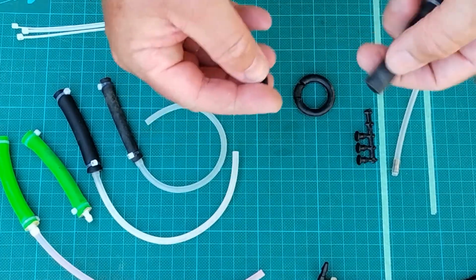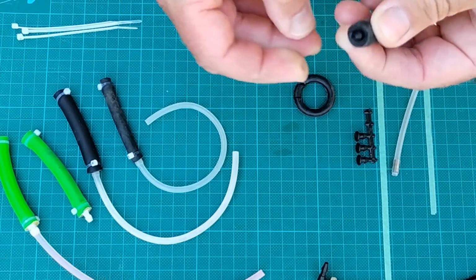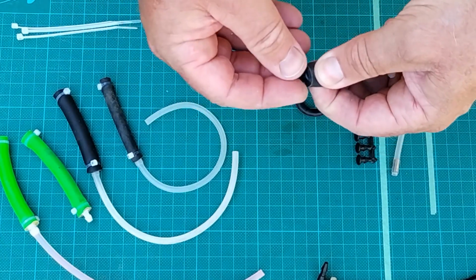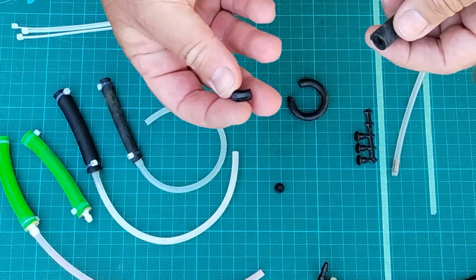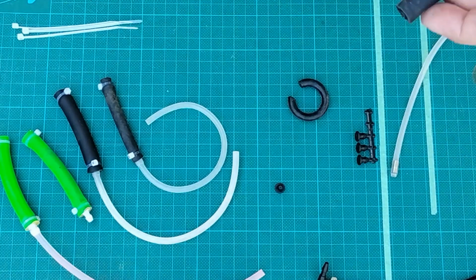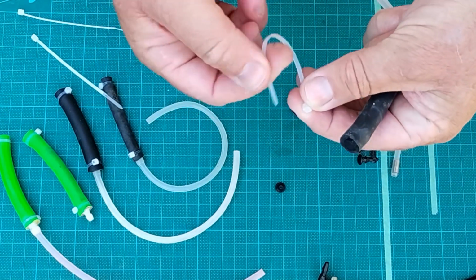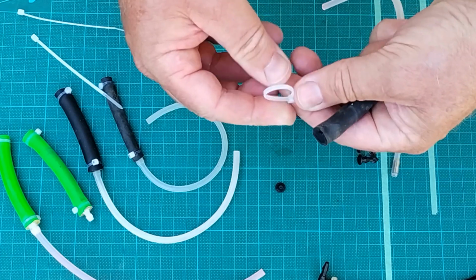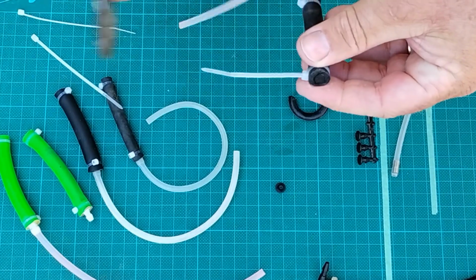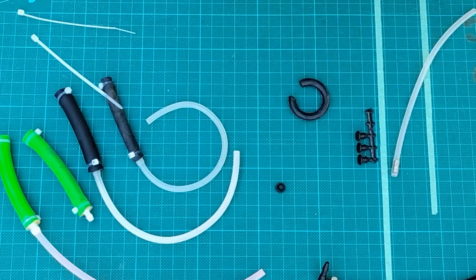And then you can either use one of these plugs, put the plug fat end first, I find, unless you've got one that's a really good close fit. It needs to be in fat end first, otherwise it'll leak. Or the thick rubber rod from an O-ring. It's probably a slightly better way of doing it. The O-ring ready. Put it right over it in the middle and pull it really tight. Nip it off. There we go.